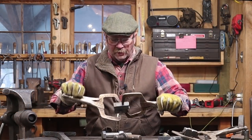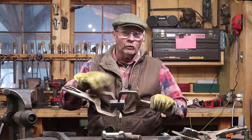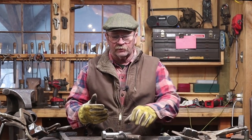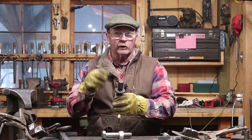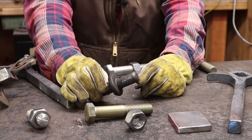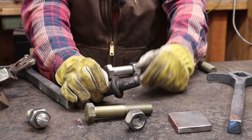I've got those initial welds done, so these will stay together. I've left the clamps on to make sure they aren't too inclined to spread as the weld cools — almost cool, so I'm probably okay. One of the key elements of a fly press tool is that it should have a shoulder. It goes into a round hole in the fly press, and that shoulder keeps you from upsetting the shank inside the tool holder — if you upset it in there, it's really hard to get back out.